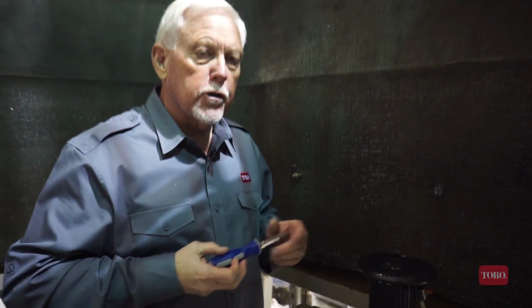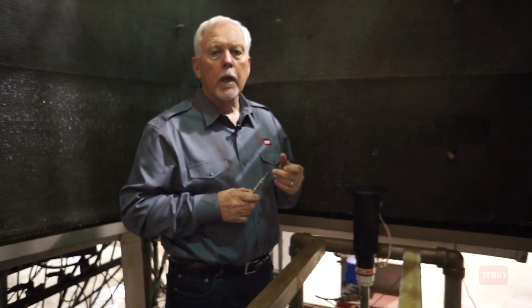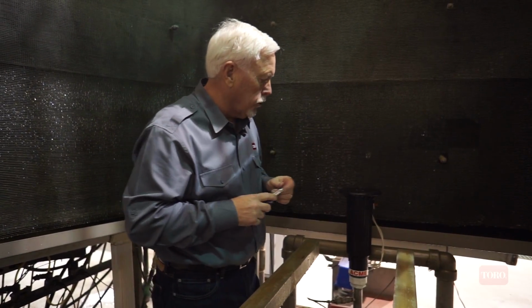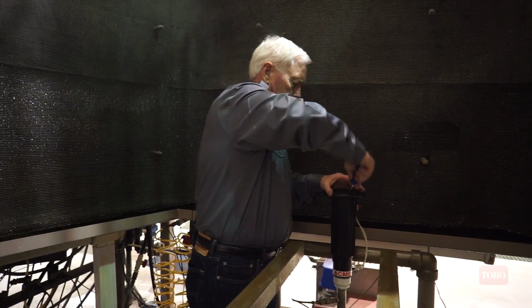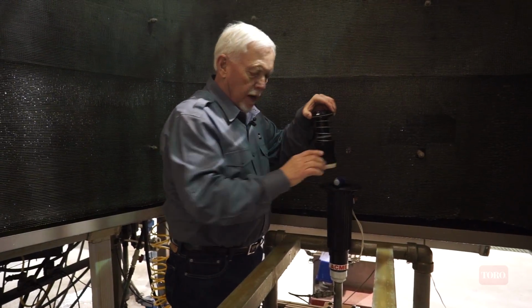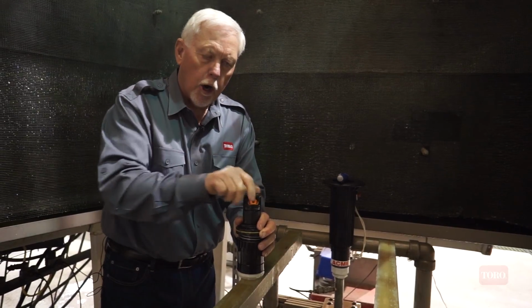Now, if I want to determine what the arc is currently set to, my two options are I either turn the sprinkler on and then I can grab the nozzle base and move it back and forth and see what the arc is set to, or I would take the snap ring out, take the riser out, and now at that point I can turn the nozzle base to see what my arc settings are.